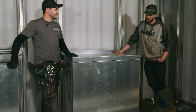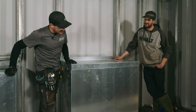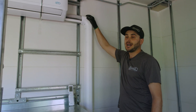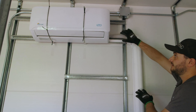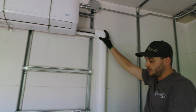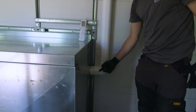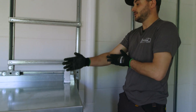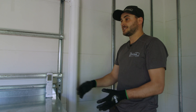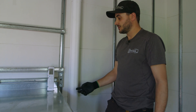I'm super excited to show you guys the preliminary version of this. Thank you, Will, for showing them how it was built — came out lovely on the first crack. I just want to talk about how we ran everything. The head units' lines go in on the other side of the exterior condenser, but we came out this side and then went all the way down and through this condenser box right here. That allows, when that condenser slides out, there's not a lot of stress on those copper lines and it allows them to flex. It could go in and out many, many times and not be any worse for wear.